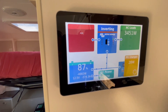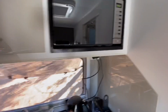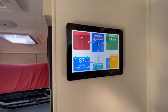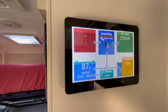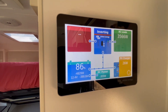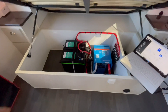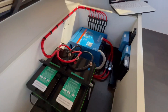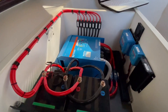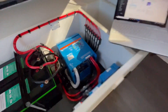Look at that — 370, 380. This is nearly 5,000 watts from these batteries. I am loving these batteries. How good is this setup? This is what happens when you do it right — when you use the quality that we stick with. Really, really thick cable, monster stuff here, and double runs as you can see per Victron spec. These don't even move. They are absolutely awesome.